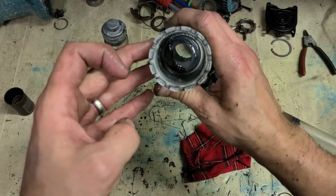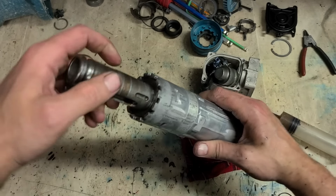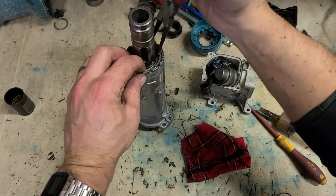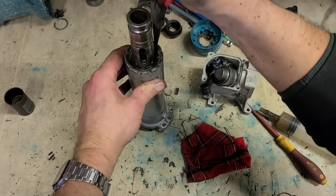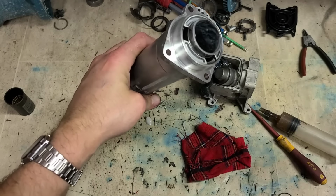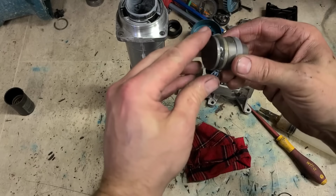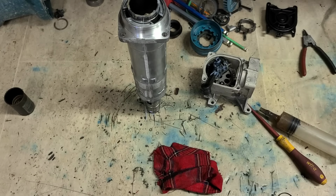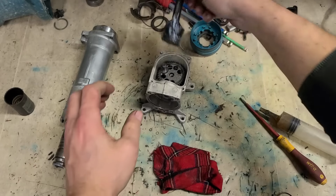The other steel washer and rubber ring are still inside the pipe, so we'll leave them in there. Push that in. Reinstall your C-clip. That bit. Good gob of grease, and your hammer. Another gob of grease. You can go to the piston.